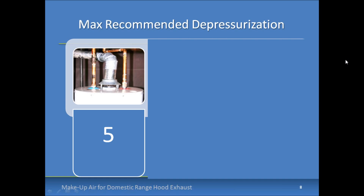Unless the building's exhaust and supply flows are perfectly balanced at all times, some level of depressurization is likely to occur when the exhaust appliance operates. What we're trying to do is not eliminate depressurization entirely, but keep it at an acceptable level. Based on recommendations from the Building Performance Institute, the maximum depressurization acceptable can be determined as a function of the type of combustion appliance. The most common metric used is the Pascal — 25 Pascals equals a tenth of an inch of water column.